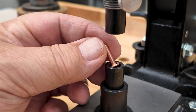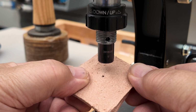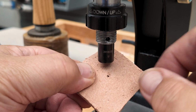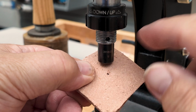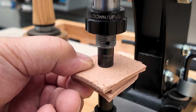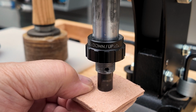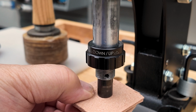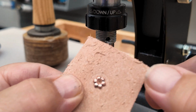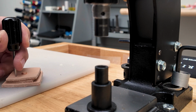This time we'll load the lower die with that rivet, and we will take our leather assembly and press it up on the upper die on top of our splash. There is a raised center, and we want the awl hole to be over top of the raised center. Then we lower the lever with the leather on the top die, and then it comes down upon the plunger and sets that rivet. And that is the best way to install these extra long semi-tubular rivets without bending.